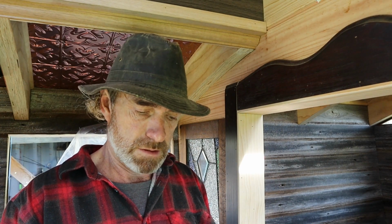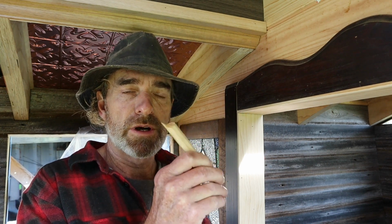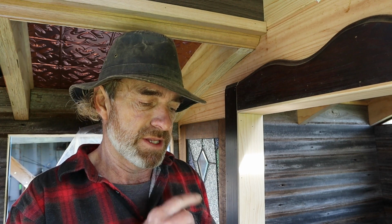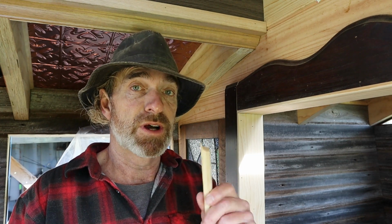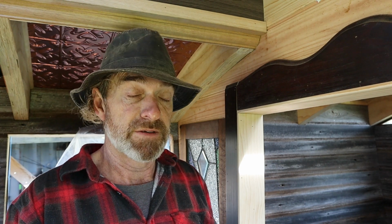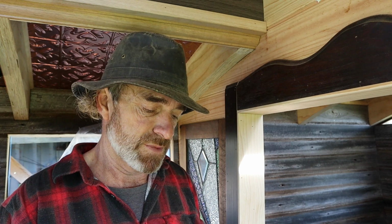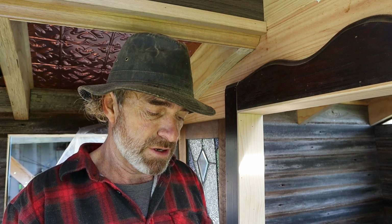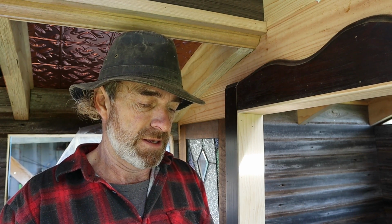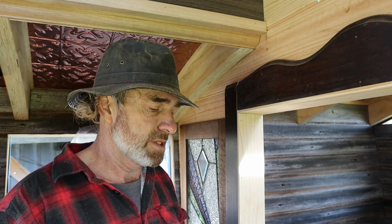You got to admire the skill of a carpenter or craftsman who can expertly scribe timbers to meet, and that ain't me. Sliding that little piece in there to meet the other piece of quad, I've just started trying to do a scribe, and it's incredibly laborious. Basically, two ways to meet two pieces of timber, say architraves or skirting. Either just cut them on the 45, butt them, and they may not be perfect, but then you just fill them and you paint them or whatever, or putty them and stain them, which is the quick and easy way. But scribing is the skilled way, and it takes skill, but I'm not at that level. It's an admirable skill. The intricacies of carpentry and woodworking.